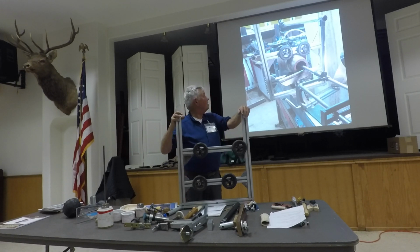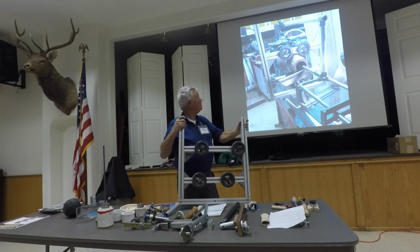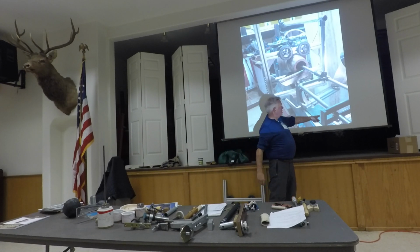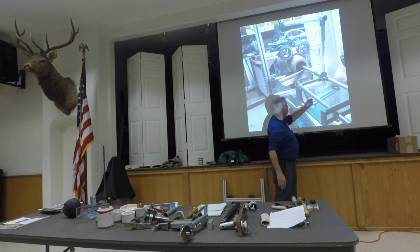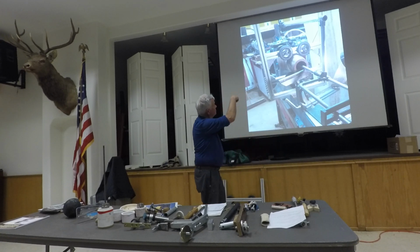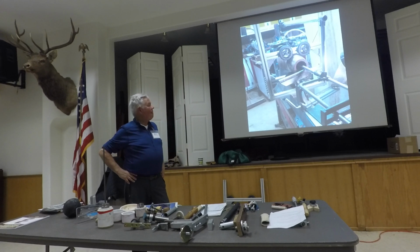And you can see there that I've got a 1-inch bar that's going into the vessel. This is the Jameson hollowing system. It's a big D-ring, and this is a capture back here, so you can just slide it back and forth. And the above is the laser that shows you where you're at when you're hollowing out. You can make them smaller, or you can make them larger. This aluminum extrusion is really easy to work with. It's just T-slots.